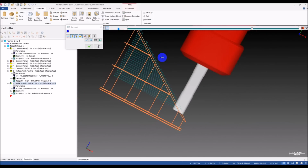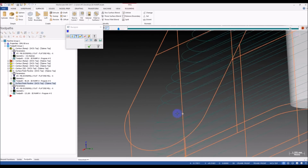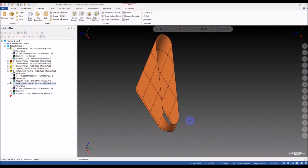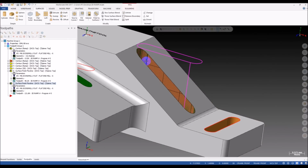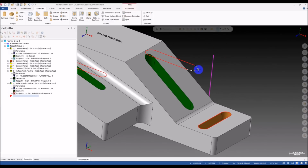You can see we eliminate the air cutting outside of the part, but have an issue here, right on the dangerous point when the arc contacts the line. So we use our trick again to see if it works or not. We delete the old surface here. Remove it. Okay, we move this chain away, maybe to the center, or far away from this, and we break this point.